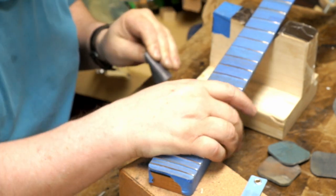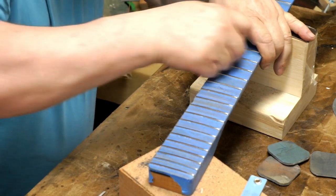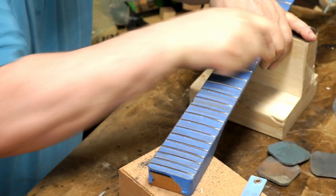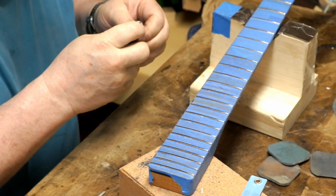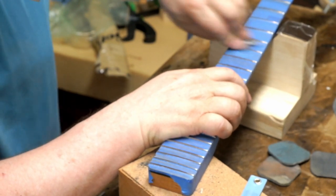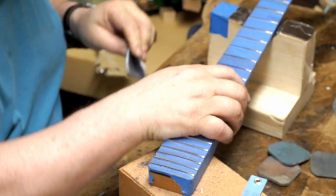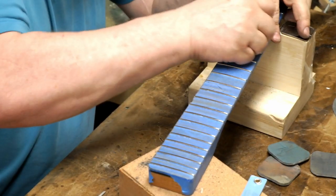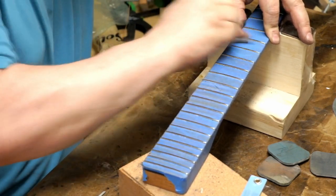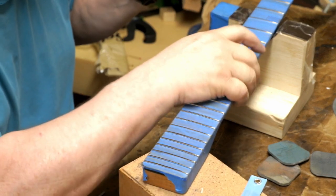This is a Washburn guitar, and the frets that I took off seemed awful soft. They seemed to kind of peel out like solder on a spool. So of course the frets I'm putting in here are world-class Jescar. I think they're 6105s. They're 55 tall and 90 wide.